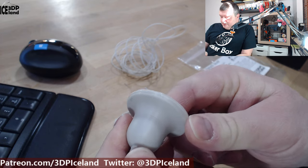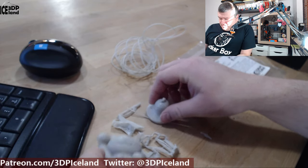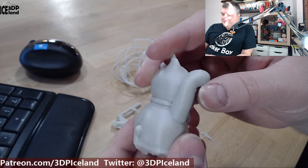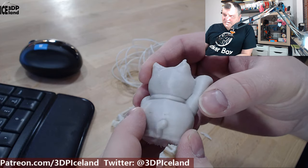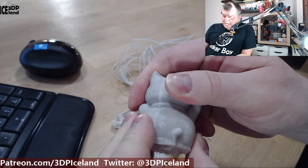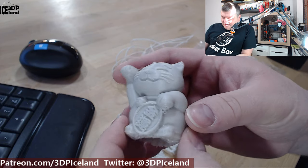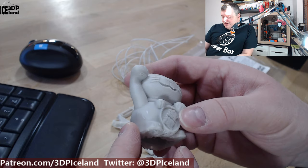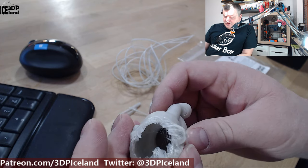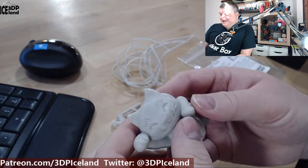So I didn't really enjoy this filament and just cancelled my testing with this one left. I think this is as good as it gets for me with this filament. It's not horrible in the surface finish, and it has a very wax-like texture when you run your finger over it. But for anything with small detail, it's not going to be a good filament. If you're doing some bigger parts it could be useful, but you have to be really careful not to remove the part from the bed until it's fully cooled down — that was maybe my impatience to blame. But this was an interesting filament nevertheless.